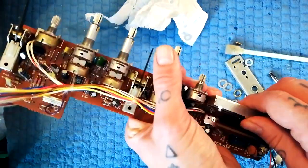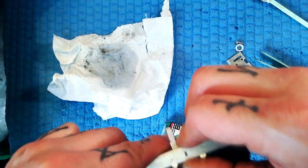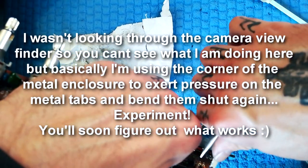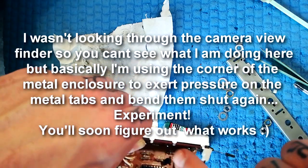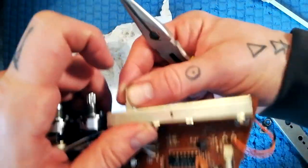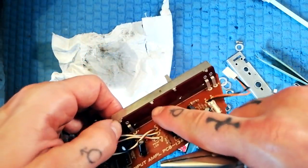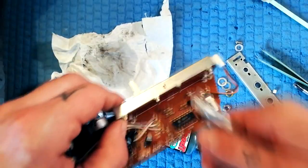At that point, push down that transistor in there and bend down this capacitor so the plate can sit flush on all these tabs. I can close it and squeeze the tabs shut using the screwdriver edge against the tab. As you do this, keep checking that the fader feels all right — it's possible to tighten these more than they were originally, which can mean it gets stuck. You'll need to loosen off and close again so it feels smooth all the way up.